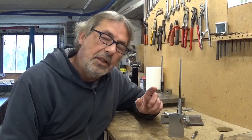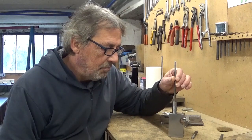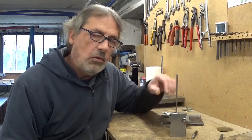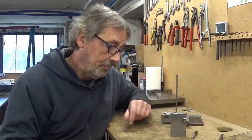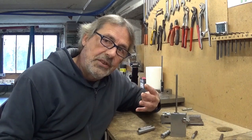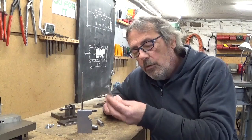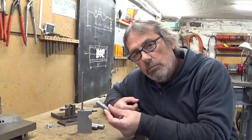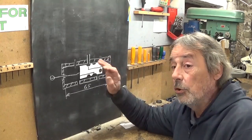This is one of those projects where about nothing goes as planned. First I had to fight a little bit with the tailstock of my lathe because I was cutting tapers. This little piston now finally fits more or less - it's a bit hard but maybe I can fix it. So I'm not really happy with the results, and because of the burr that was inside I didn't notice. I made four pistons. The first one didn't fit because it's too much tapered. Second one cut too small. Third one looked good, drilled the holes and all - also too small.